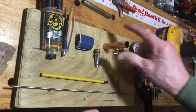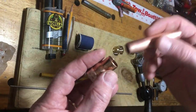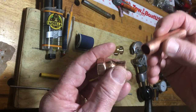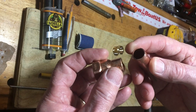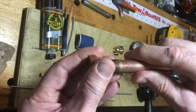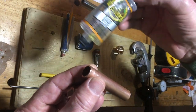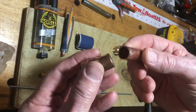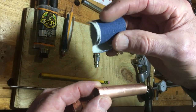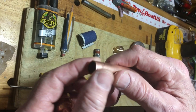The other thing we're gonna need is something to put that in - this is just a half-inch female threaded copper fitting. All this stuff is available at Lowe's - I prefer Lowe's, they treat veterans well. We need to put the copper into this fitting, but we can't just put it in there. A lot of guys don't want to spend time soldering - all you need is a little bit of epoxy, you can get it at the dollar store. Go ahead and rough this up a little bit with some sandpaper. I recommend always buying a roll of plumber's sanding tape - it's really handy.